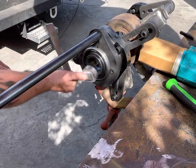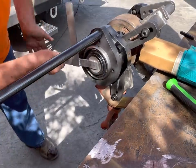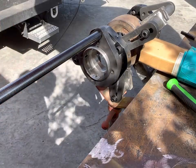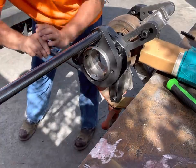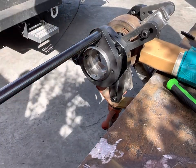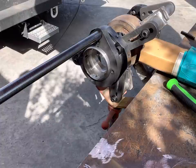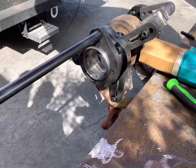That seemed to have helped me a lot. And then you want to kind of line it up with, there's grooves right here. Line it up with the grooves, comes right up. So after you do that, now you can fully tighten this screw here, making this bar so that it can't move. Because believe it or not, this will actually squeeze that just enough to where you can't get that bearing out. And if you're not paying attention, it could be a real pain in the butt.